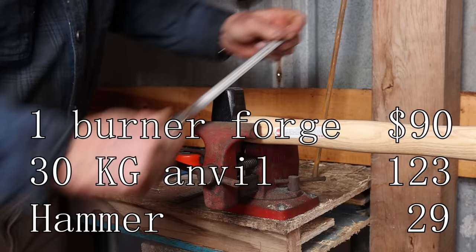Now, the forge weld on the little bending fork was not successful, and that doesn't really surprise me. I think this could have sat and soaked and built up heat for a little longer before I tried that, and maybe even left this in the forge for a little bit longer. But at 6,500 feet, not all gas forges are going to forge weld anyways, and I really don't know that it's realistic for such a simple, budget-friendly forge to reach those kind of temperatures.